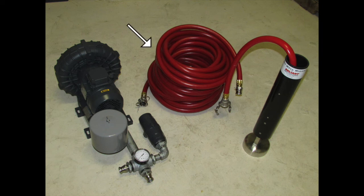The air feed hose is made of a 2-ply polyethylene PVC and nylon braided air hose with 316 stainless steel camlock fittings on both ends, and a low-volume, high-pressure 2-stage regenerative blower that can drive up to 4 wizards depending on the volume of the lift station. Blower horsepower is based on the depth of the wet well, the altitude of the lift station, and the number of wizards at that lift station.